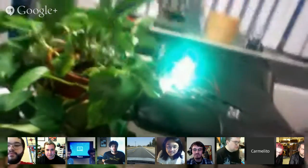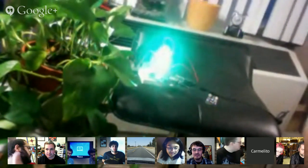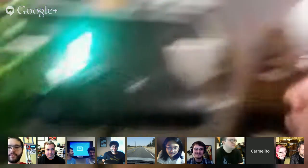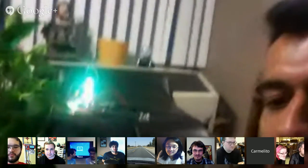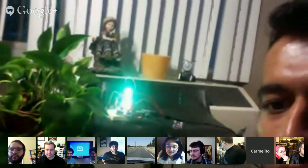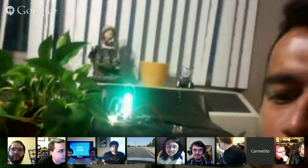One of my friends moved from Stanford to California, so they wanted to trust me with their plants. So I built this real quick thing where she could get a status update with respect to how the plant is doing. I also have a webcam down here which takes pictures. The best part about the Arduino Yun is that since it has a Linux part and you could have Python programs running on it, you could do various kinds of stuff. So I used a Twitter library called Tweepy, which does all the OAuth and all the other good stuff for you.